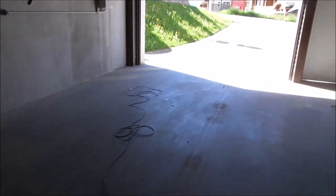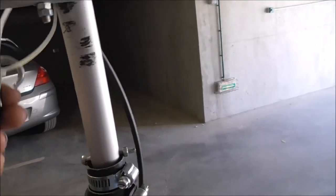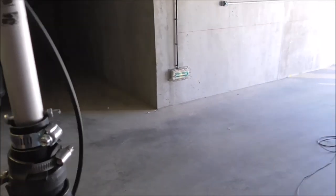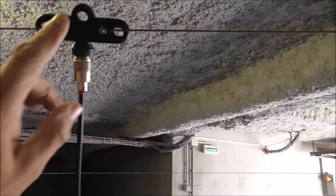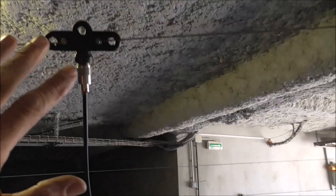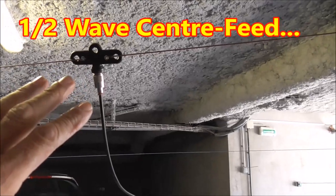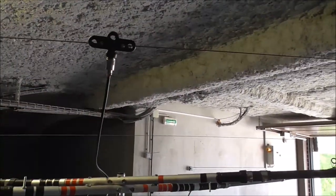So, the coax. I've got 12 metres of coax, which is plenty sufficient. It clips onto this, which means that it's not actually pulling down on the antenna itself. There's a little bit of weight in this, but not much. So that's the main connection, positive, negative. Basically it acts as a dipole, a quarter wave dipole, one side negative, one side positive.